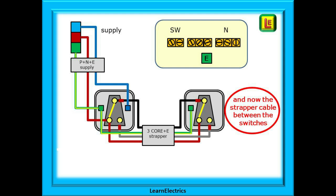The black and grey wires must be oversleeved with brown sleeving or brown tape at each end to show that they are phase conductors and that at some point they will have 230 volts on them. The earth must also be suitably sleeved in green and yellow. Starting with the switch on the left: the black wire goes into the common terminal, the brown wire goes into the same terminal as the permanent live or first brown wire, and the grey wire is inserted into the empty switch terminal. That just leaves the earth to connect. At the second switch, the black wire is inserted into the common terminal, the brown into one of the switch terminals, and the grey into the other. Now terminate the earth and that part is done.